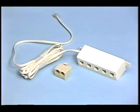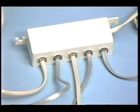A single-room intercom system can be quickly connected and tested by using a standard two- or five-way telephone splitter. To wire this small data intercom, simply plug the telephone wire supplied with each bus driver into the female jacks of the five-way splitter. Don't connect the male pigtail. You needn't worry about installing the termination resistor for an intercom contained on less than 100 feet of wire.